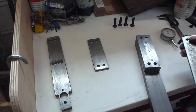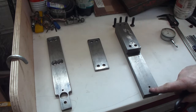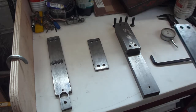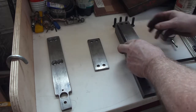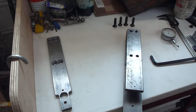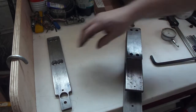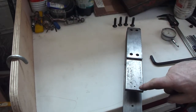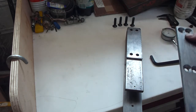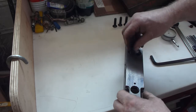Now, so that is the base. The front hole where the ball bearing goes in the other side, I've drilled and tapped to M6, which may be a mistake, but we can always drill it bigger. This plate here, which is held in by 4 bolts holding the top on, has a hole that I drilled in it for 4mm, which I think is a bit small.